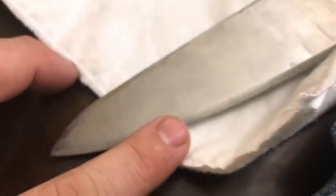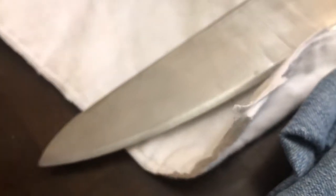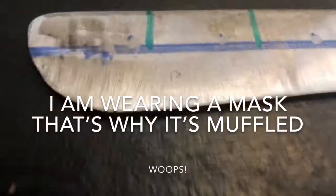But you know, it works on the same principle as what I'm doing here. One side is high coarse. The one disc sander in there is high coarse. It is meant to grind in the actual bevel. And then the other side is just a flat disc that has a high grain count, probably in like the 400s to 1,000. So maybe even more. I have a stone that's 3,000 to 10,000 in it. It's working, I'm getting there. Anyway, I just wanted to show you real quick.